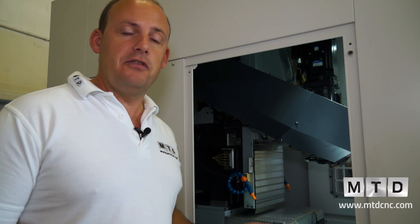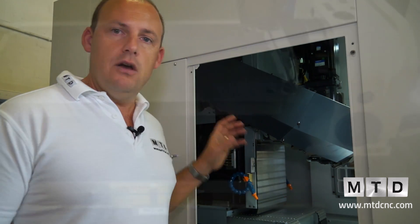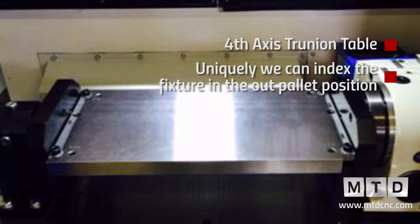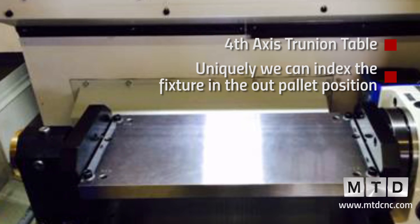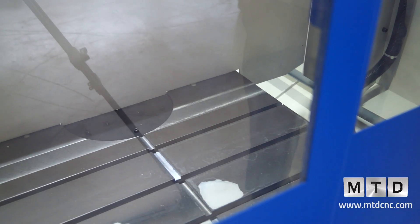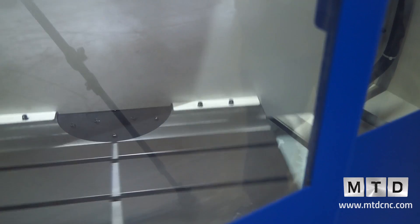The table itself can take up to 200 kilograms in weight, demonstrating that the machine isn't just for lightweight components. As with most machining centres, you can have a fourth-axis trunnion table — you can actually have two on this machine, one on each pallet. With a twin-pallet machine, one of the key benefits is that you can be loading the machine while a machining process is actually happening.